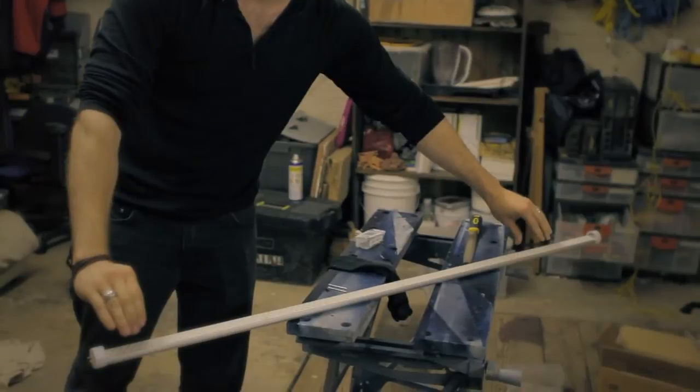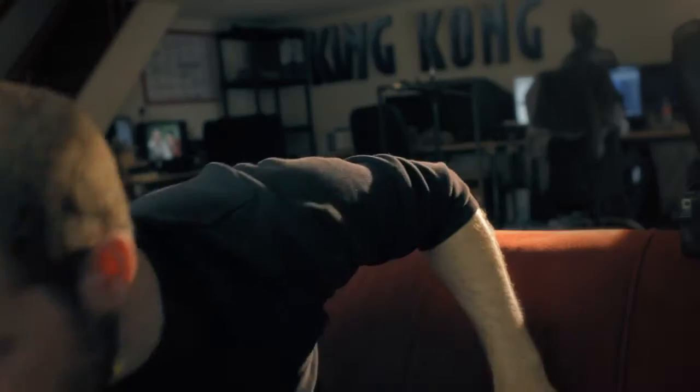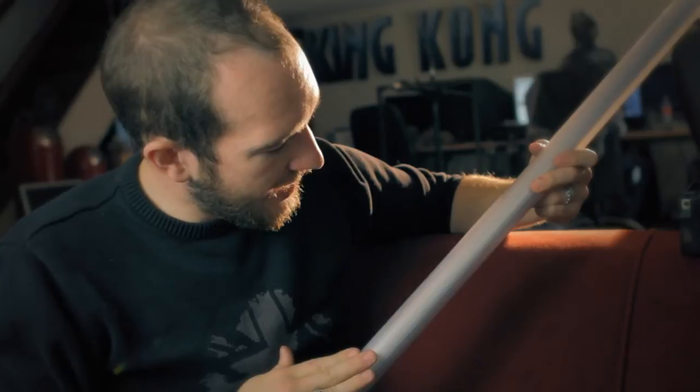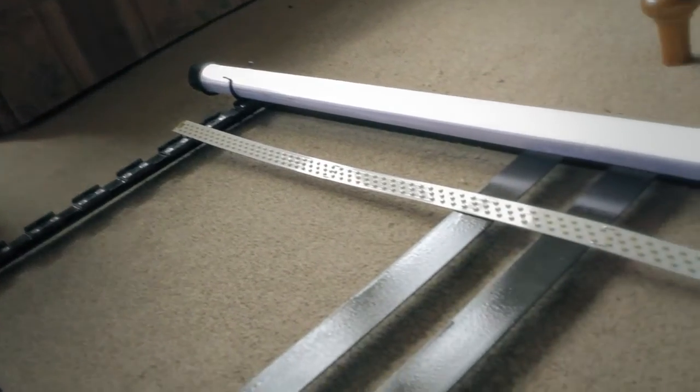We've mounted the LEDs on a piece of aluminium backing to work as a heat sink, and put a frosted covering over the top to make the light even more soft and even. We then sourced 30 metres of PVC tubing — very flexible pipe — and by cutting the right size lengths and fitting our LED light tubes inside them, then sealing the ends, we've created these batons. These batons are almost exactly the same size as a Kino tube, capped on the end with rigid plastic sealed with a PVC weld. On one side is the aluminium extrusion acting as a heat sink and providing strength; on the other, a frosted white diffuser. They're very bright, very strong, completely solid state — we can drop them without worry — and they use half as much power as a fluorescent solution.